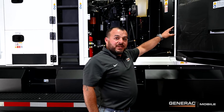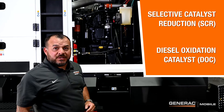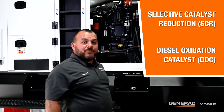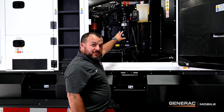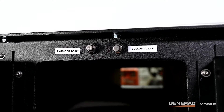On the front side of the cabinet, this unit also houses the SCR, selective catalyst reduction, and also the DOC, diesel oxidation catalyst, which help reduce engine emissions to meet stringent Tier 4 final requirements. Conveniently located on this side of the engine is the crankcase ventilation filter, the oil filter, the fuel filter, as well as these convenient drain locations for servicing the engine.